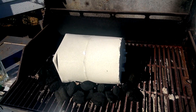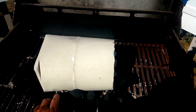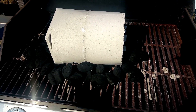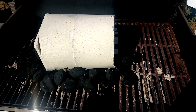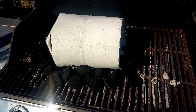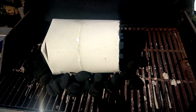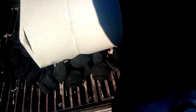Here it is on the barbecue. This is a gas barbecue, but I've got charcoal briquettes along here. I do that just because it helps raise the temperature — they burn fairly long, so it keeps the temperature up and I use probably less gas. It just keeps it really hot in there so everything melts out. It might take all day. It's a fairly large mold, so we'll see if we can get this burnt out and poured today.